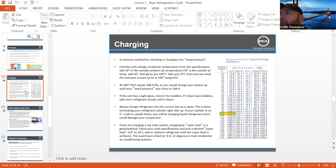How do you know the difference between undercharged or overcharged if you're seeing bubbles when dealing with blends? The new stuff like the 448s has an even bigger glide than the 407 series. A quick check: if I'm a little bit warmer than room temperature on that liquid line and I'm bubbling, I'm probably low. If I'm hot to the touch — close to discharge temp, not condensing — I'll still see bubbles. Keep two fingers on the liquid line as it's coming out of the condenser while charging.